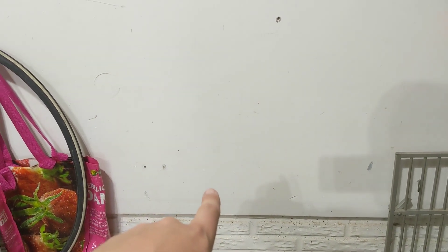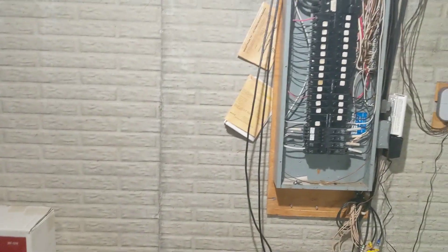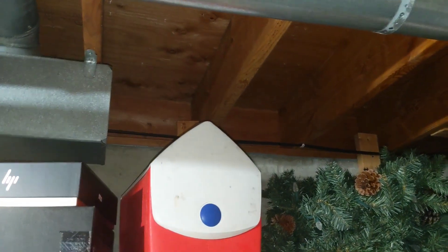We're going to go right through the sill plate area into basically the floor of the main floor of the house. Down in the basement, we have the panel cover off. We'll make some spaces with tandem breakers, come across the ceiling, and poke through about right there above that cooler where my finger shadow is.